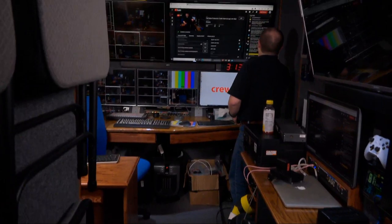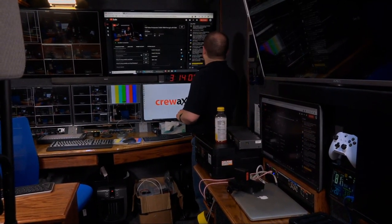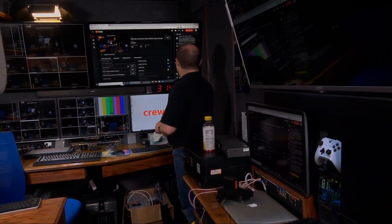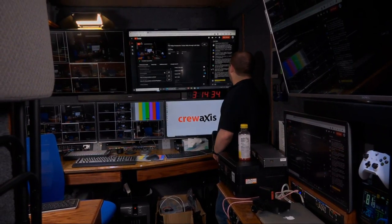For audio and video sync — I haven't had to worry about that much. The cameras I use have so little latency that I don't have to delay the audio to get good lip sync. For feeding audio in Blackmagic Studio Converters — I'll cover that when I get to the equipment racks. When converting SDI to analog, Blackmagic makes one that I use often. There are times when I have to interface into an old standard-def video system and I'll use converters for that.